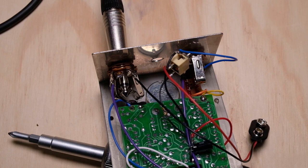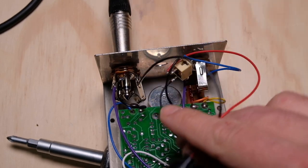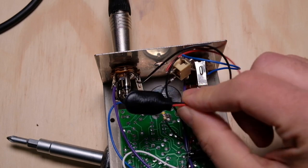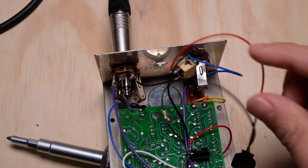It's nothing fancy — it's not a true switching connector. It's just a very convenient little hack that uses the sleeve on the quarter-inch jack to pass the current. Having said that, I am going to remove this and only power off the DC input. I just don't use batteries, so I'm going to take this off — not going to be a problem. Just going to pull it off, and that's it.